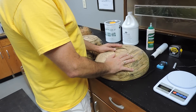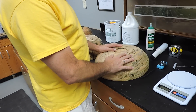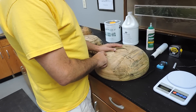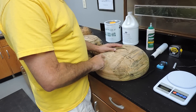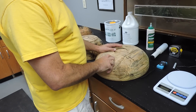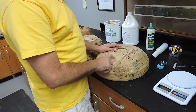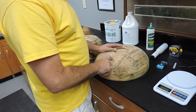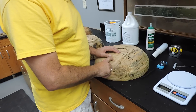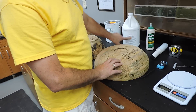This is what I have here to show you. When I turn a bowl and finish it, I want to date it, tell what it is, weigh it, and I like to check its moisture content. This particular piece was at 34% when I checked it. I've kept real close tabs on this one because it's the one I used the Packard's wood sealer on.